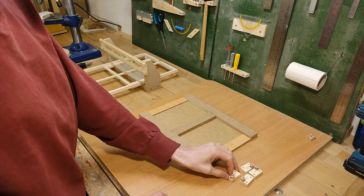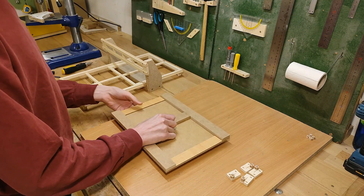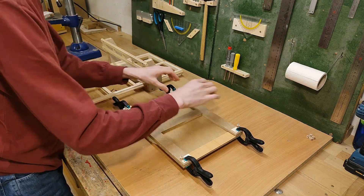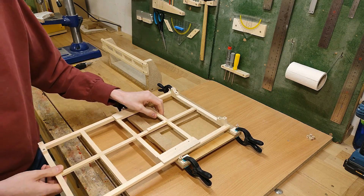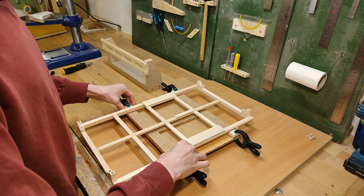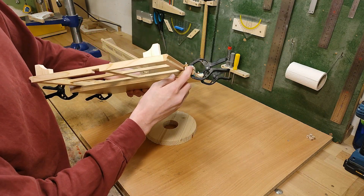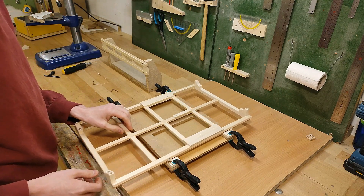To install these springy blocks on the print bed, I unscrew the y-axis again, because it would be kind of inconvenient having to move the whole thing around. So let's put the print bed on a little spacer so I can clamp on these springy blocks, make sure they're all the right way around, and now I'm going to insert the y-axis upside down into the rollers. And this is the point where I realize my math from the CAD model didn't quite add up, and things are sticking out where they're not supposed to. I should have made the y-axis a little bit less wide, because now these springy blocks are sticking out. But it seems like this is rolling very nicely already.